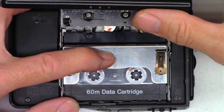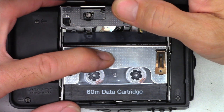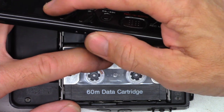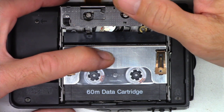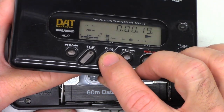Probably a tenth of a millimeter is about all I need. I did some measurements with the micrometer and determined that the capstan motor shaft is currently about 17.6 millimeters in length. I want to get that to about 17.7 or 17.8 millimeters, so let's see if I can take care of that task.